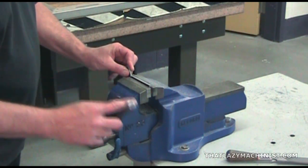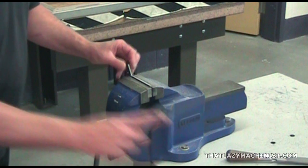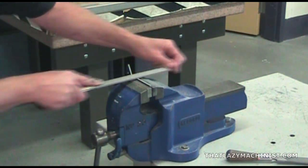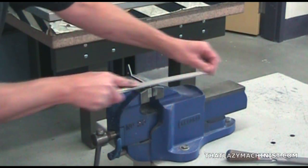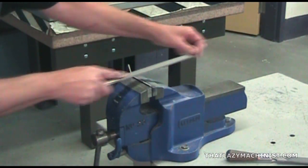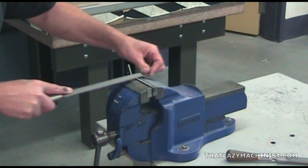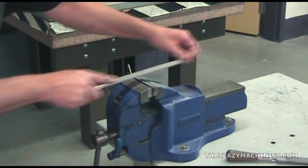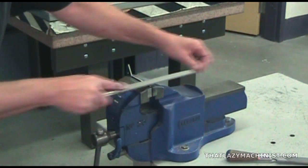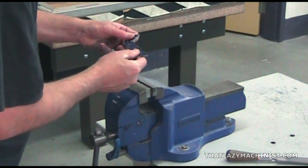You have to remember that these are our finished surfaces we're moving towards. So even if we're roughing out, we're not going to be leaving very much material for finishing. So be very attentive to details. Remember, in the machine shop, we always want to work accurately. You may have noticed that I'm filing away from the 59 degree surface. That's because I really want to avoid notching it.